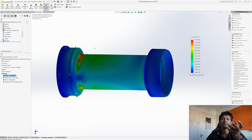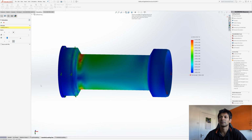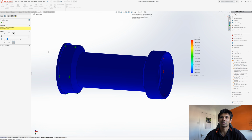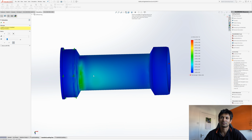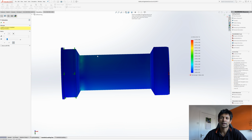And you're probably wondering, well, why does he put the effective weight of a car? The reason is because of fatigue loading. Every time you pedal, you are putting your right foot down, then your left foot down, right foot down, left foot down. You're creating a cyclical stress, and this SolidWorks system will demonstrate a cyclical stress. So when it's blue, that's unloaded. As it starts to go red, that's loaded. The red areas are where you are going to get the highest stress. So unsurprisingly, it's very close to where I put the stress raiser in.